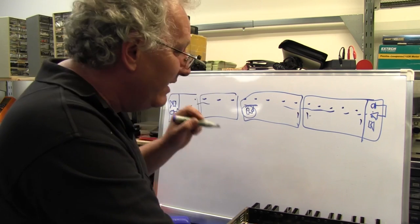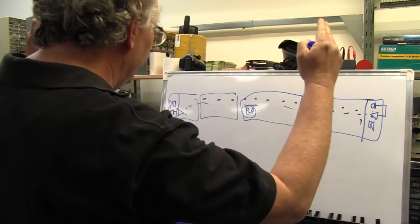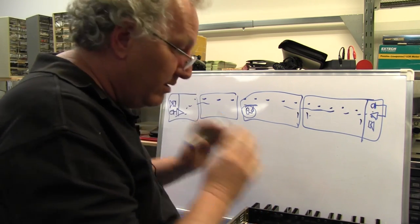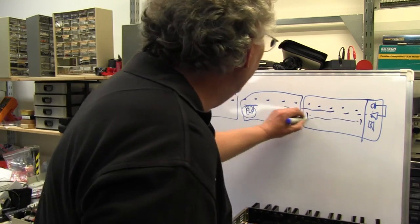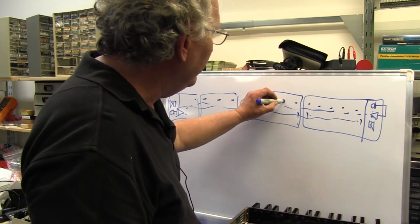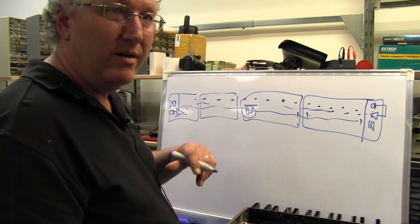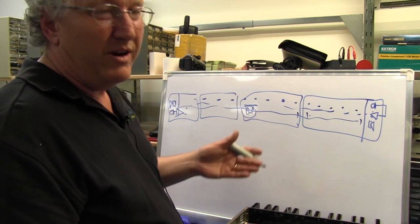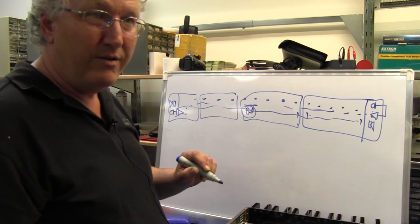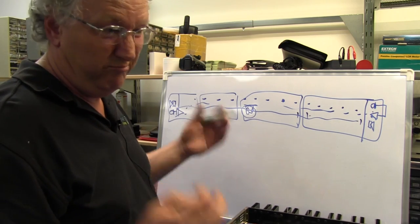Stick around. The amplifier section used for public address, particularly because it might be addressing the speakers in 8 carriages, sometimes up to 16 carriages. Much higher power, 150 watts. Separate set of lines reticulated right through. Again, 100 volt stuff. But each of these little 4-inch speakers is, I think, tapped for about half a watt or one watt load onto that line. So if they're tapped at half a watt, it means that you can put 300 speakers onto that 150 watt amplifier. And the amplifier will treat that with perfect aplomb.